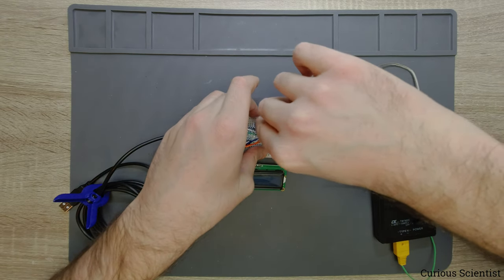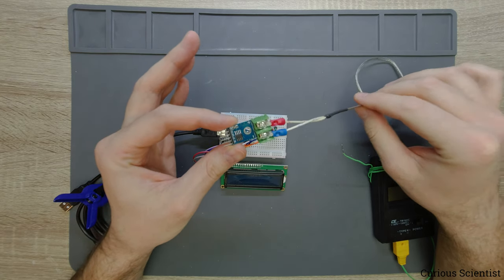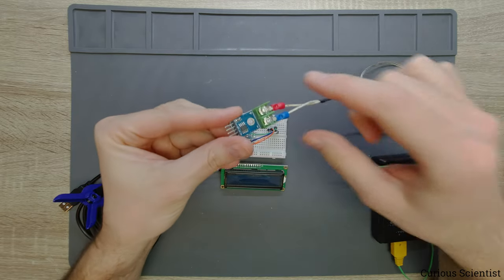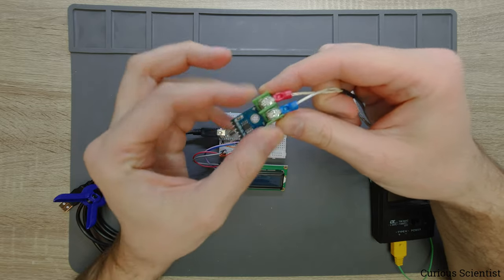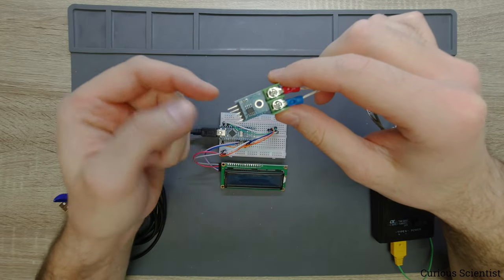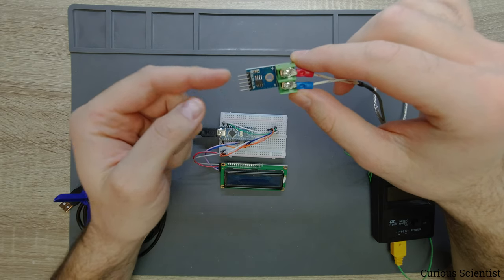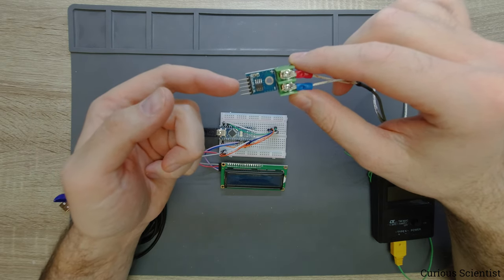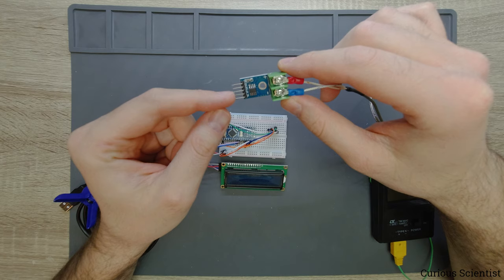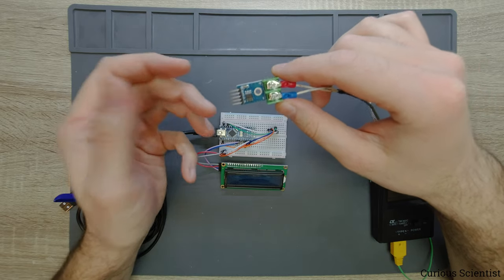The basic circuit is this one here, which is already in the breadboard. It's a very simple tiny PCB. There is barely anything on this circuit — we have two big plastic terminals with some screw connections, and then there is the microchip and just a filtering capacitor. We have five pins: GND, VCC for the power supply (5V is just fine), SCK which is the clock, CS which is the chip select, and SO which is the slave output.